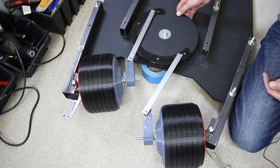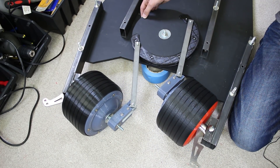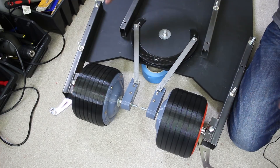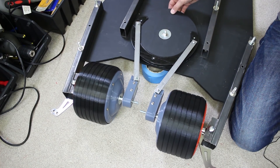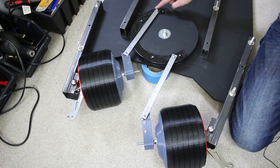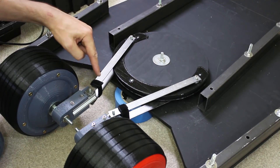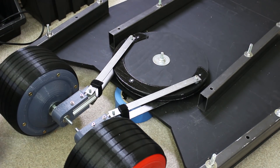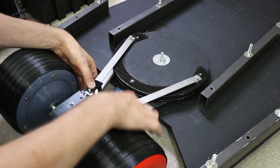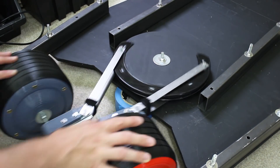The wheels on the first go seem to track each other pretty well - they look pretty parallel. Technically they shouldn't be; one should steer more than the other, which is Ackerman steering, but for what I'm doing I'm not too bothered. They do toe in slightly as well, which means they point inward when in the middle, and they remain largely parallel at all stages of rotation, so this spacing looks coincidentally pretty good. I've added parallel links now - they're just attached with velcro to each other to stop the bottom one falling off, but that's much more rigid around this pivot point.